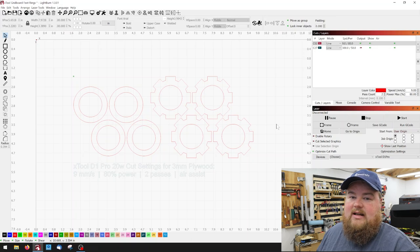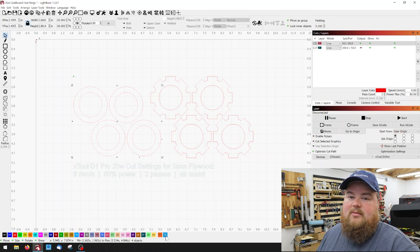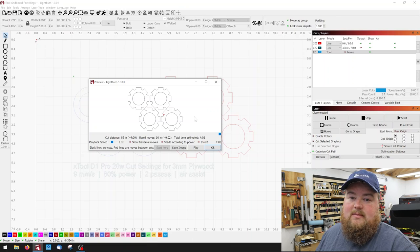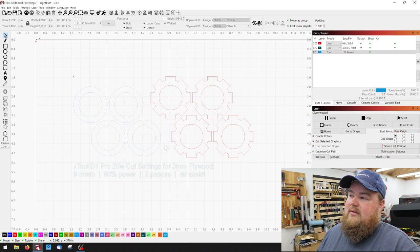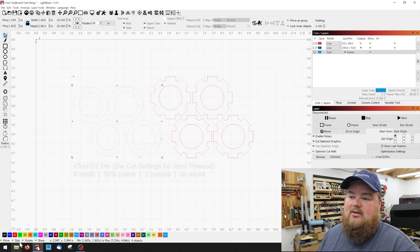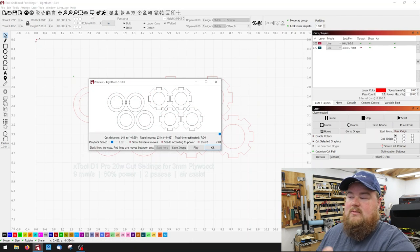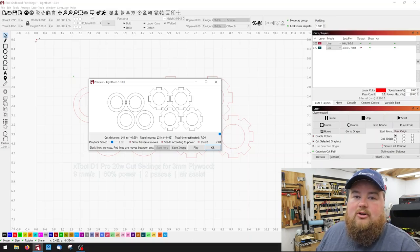If you know you don't want one design or the other, you can easily click, highlight, and delete it, or down at the bottom you can click one of your toolpath colors — T1 or T2 — and that makes it so it doesn't output to the laser but saves the design. As always, before you run a job, click the preview button up top to see what's about to happen. I can see I'm only cutting the gear feet, but if I want to do all of them, I select all, go back to the red cut layer 2, and preview again — now we're cutting all 8, which is what I'm going to do next.